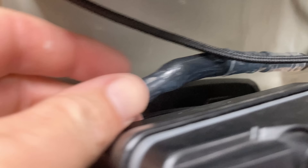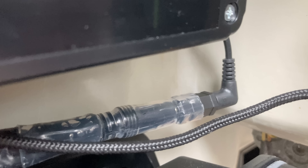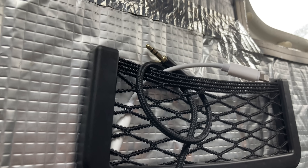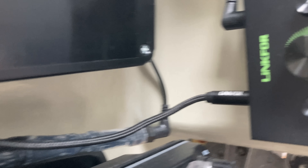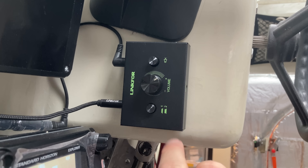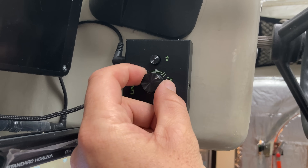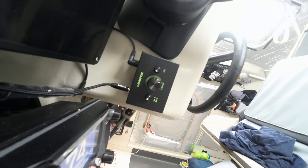Let's finish up with two positive stories. I've improved the radio audio system. This is the mono speaker output of the VHF, which I put through a mono-to-stereo converter, and finished it off with a standard 3.5mm mini jack socket — that's how I've been using headphones to hear people clearly. But now I got one of these, a channel switcher. It means I can listen to something else — perhaps from my phone or laptop — but then in an instant tap the button when I see the green light on the radio or hear the main speaker crackle, and hear the radio feed instead. The speaker output volume control and this give me extra control.